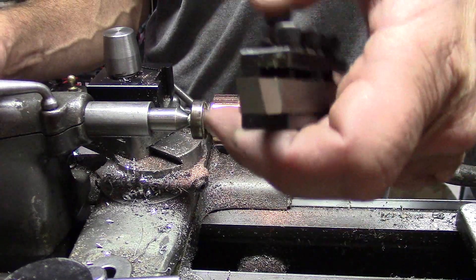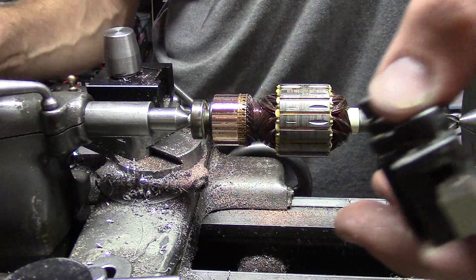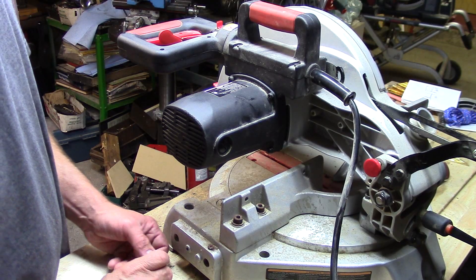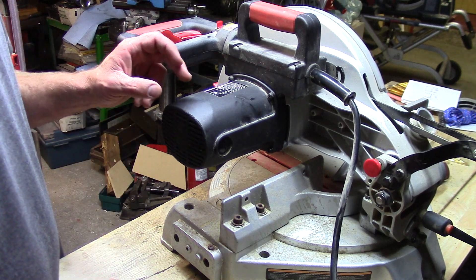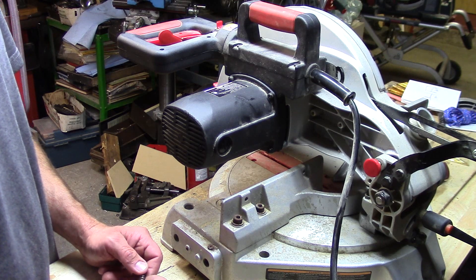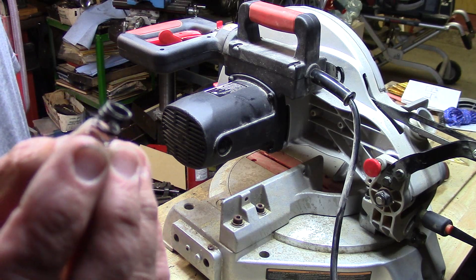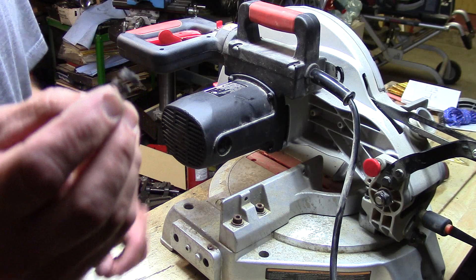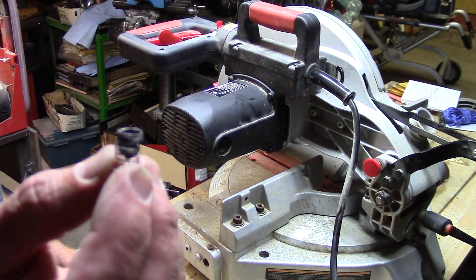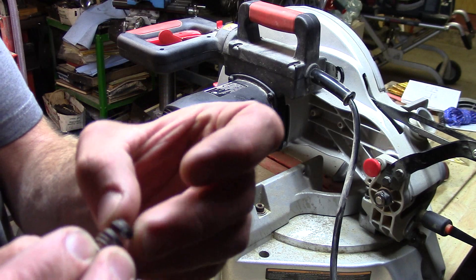So that's it for tonight guys. Maybe I'll put this together and show the rest that it works — pull the saw back together. I think the main problem with the damage to the rotor was this spring here that goes on the brush. The brush on this side wasn't holding the brush in contact with the copper well enough. It's really overheated — it's fused together actually in a few little places.